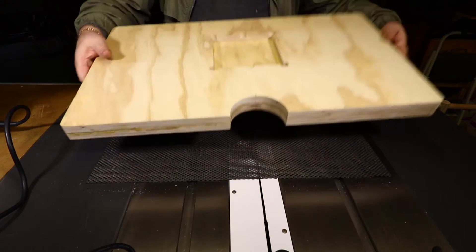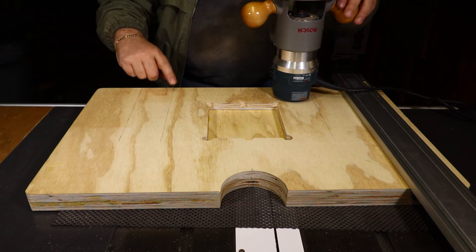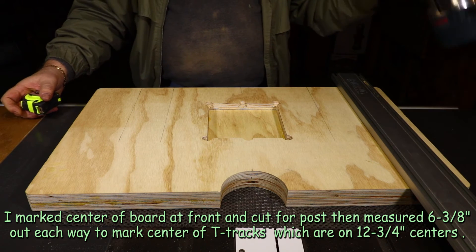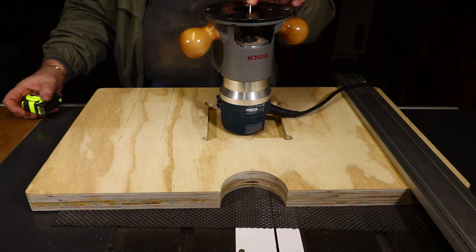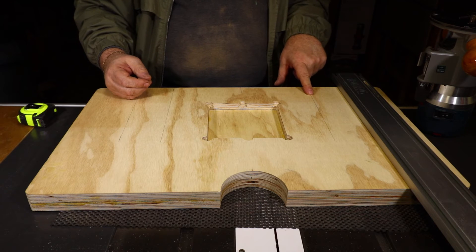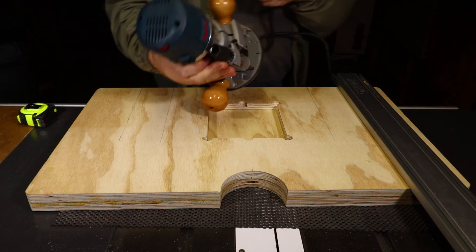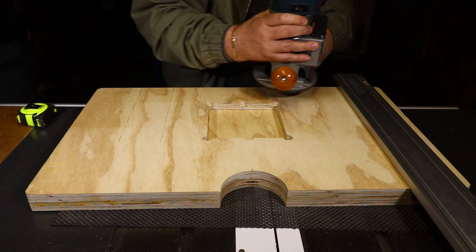Now I've laid out where I'm going to put in my T-tracks. The center of the tracks are located 12 and three-quarter inches from each other. The center of my router bit is three inches from the edge, and I've got a three-quarter inch bit set to a depth equal to my T-track — tested on a scrap piece. I put this Bora clamp guide on here, marked out three inches from the center mark to this edge, then set up my guide from my router at three inches, because that's the distance from the edge of the router to the center of the bit. I have a little Sharpie mark on my router that I always go from to make sure I'm consistent.